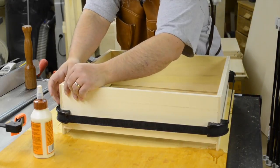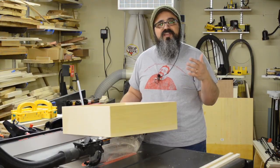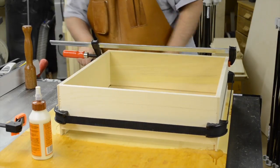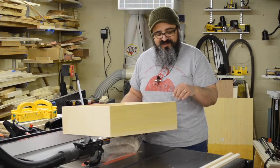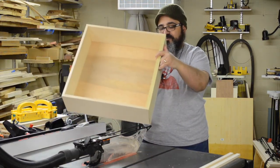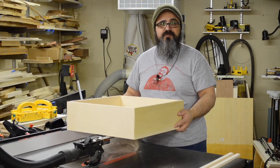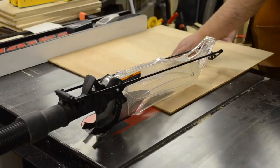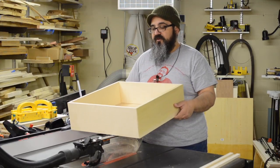Once I got the band clamp in place, I really wanted to make sure the joinery at the front is as tight as possible. So I came back in with a single bar clamp and added a little extra pressure to help keep everything in place so that if something shifted when moving them to the side to dry, it would help minimize that. The last thing needed for the box was to cut the bottom. This is just a simple piece of plywood — I had some scrap pieces perfectly sized for these small boxes, so I just simply ripped it and then cross-cut it, and now it's all in place and set to go.